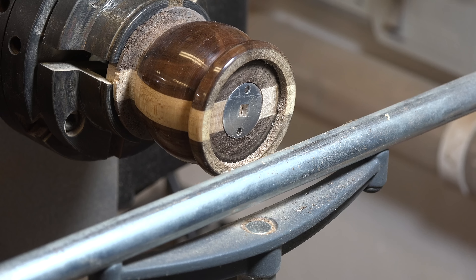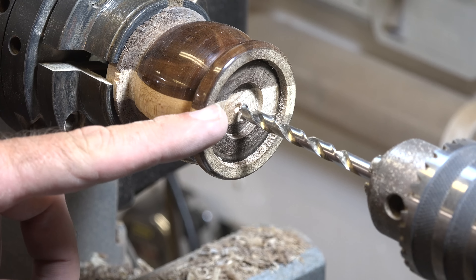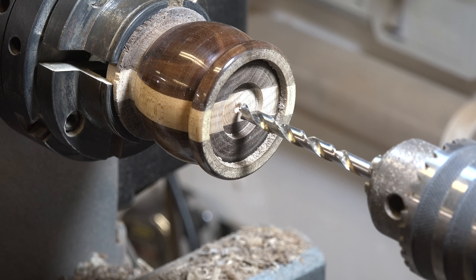The drive plate fits in — now pull that out and we have one more hole to drill. The very last hole is going to be the through hole that houses the rod that goes up through the pepper mill. For that we're going to use a quarter-inch brad point bit. Take it slow — in about a half inch, back it off, let the bit clear the chips, then in another half inch, and carry on until the hole is drilled all the way through the head. You don't want this bit to wander and have your hole come out the top way off-center.